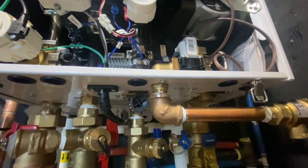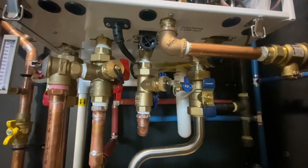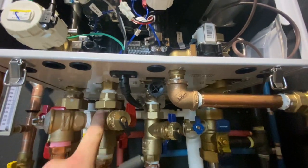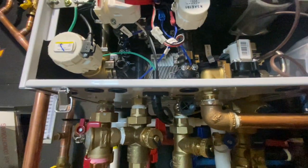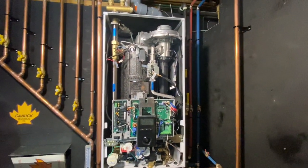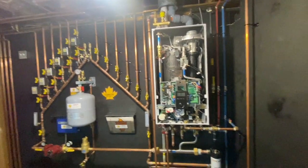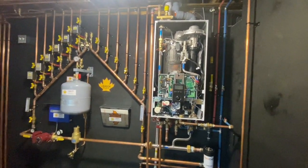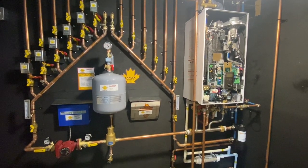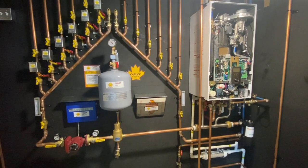Here is our domestic cold inlet filter - this should be pulled out and serviced because if it plugs up, we won't get enough water flow across the heat exchanger and won't get the gallons per minute we need for faucets, tubs, or domestic hot water. On the outlet we have a small sensor probe for domestic hot water temperature. That's a brief summary of this unit - it looks very complex but makes a lot of sense in a greater context. We are done and complete with this install. Like, subscribe, comment, and share. The next boiler on-demand system has a little surprise, so keep your eyes open. James from Canuck Mechanical signing out.